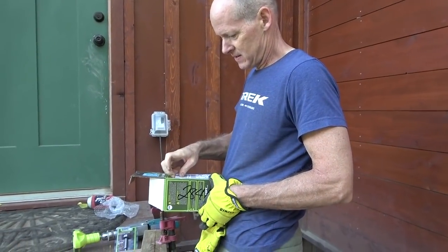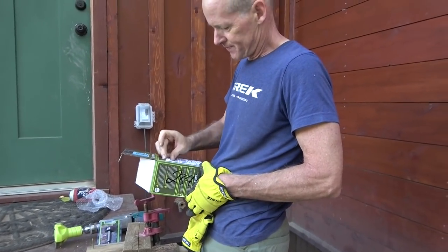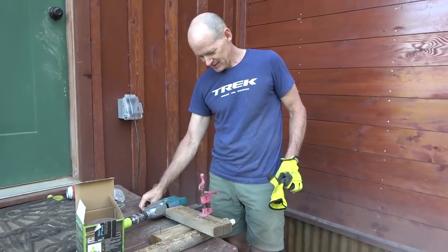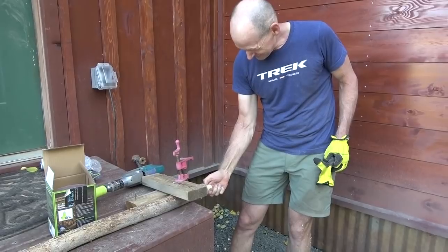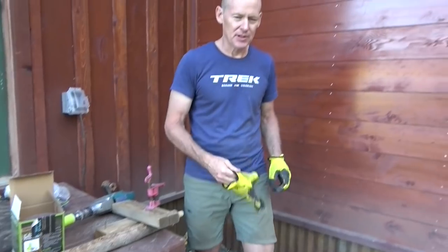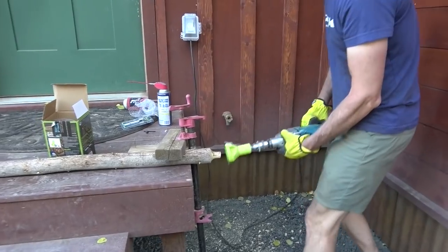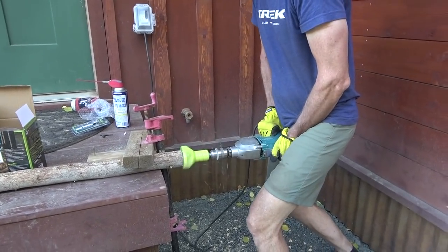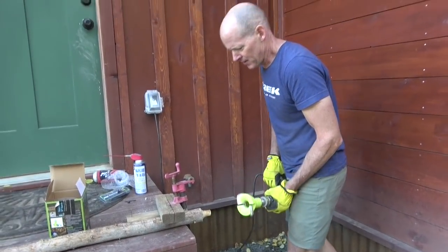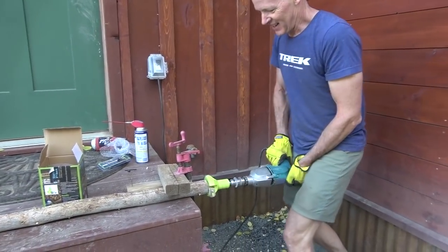So this is the TimberTough tenon cutter, 1 inch, to do the railing spindles. It works, yeah. There might be a little bit of tweaking involved to make it work better. Maybe putting a little oil on that wood. Grab some WD-40 and see. Got rid of the noise. It looks like you're starting a little fire there, like smoking the oil, at least.